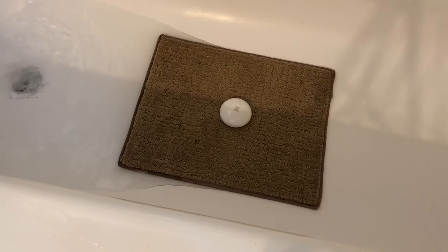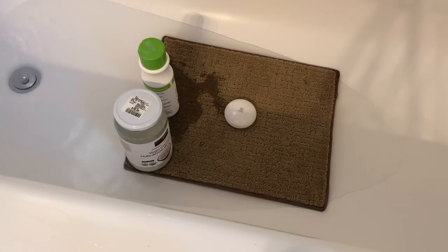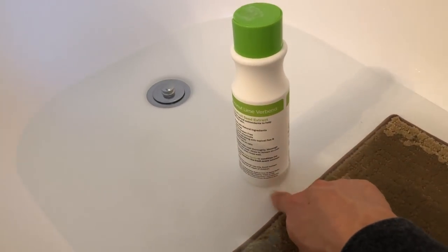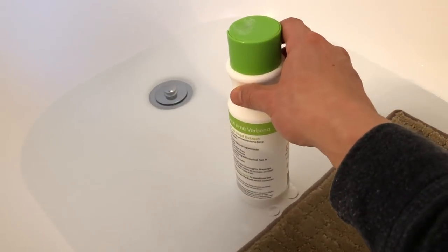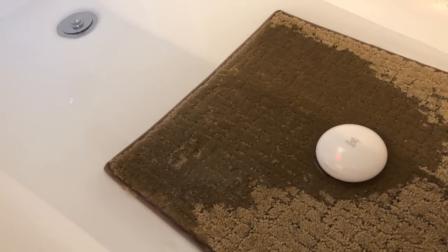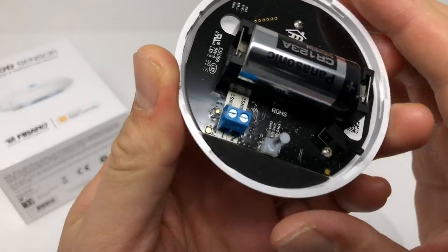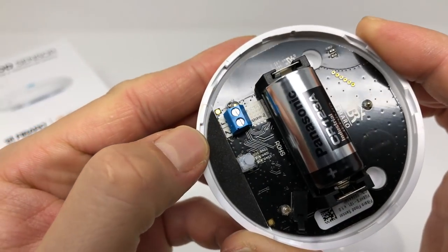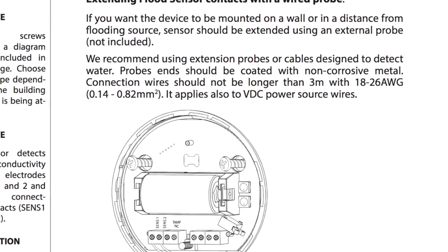In the second test I took another carpet square, placed it in my bathtub, put the sensor on top, and slowly filled the tub. The unit only triggered when the carpet was almost submerged. Keep in mind this was a carpet sample with no underlay, so the tub probably needed to fill another half inch before the Fibaro flood sensor triggered — that's a lot of extra water before you get notified. I'm not sure I would use this in a carpeted basement, because by the time you're notified there could be an inch of water and your carpet will be completely soaked. The Fibaro flood sensor does allow you to attach a wired probe, but there are no probes in the box and I'm not sure where to buy them — the manual just says you could use regular wires.